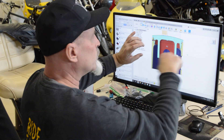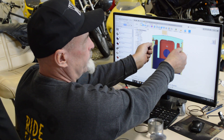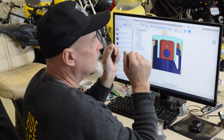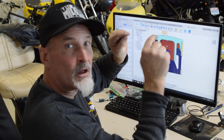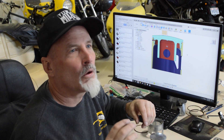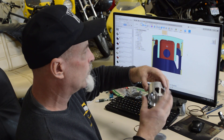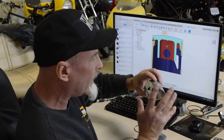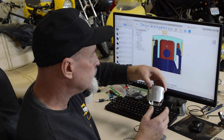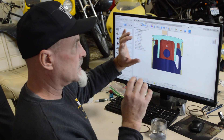We still need to use the trapped ring, so I'm thinking maybe a washer — with the focal point down a little bit — whether that will still rock and push the washer up and trap the ring. I might have to put another shoulder that separates those two. This is going to make a piston that's already a little tricky to make even more tricky, but that's okay. Looking at the wear, I think we've got it down — beautiful wear all the way around, not at the top like before when I was expanding too much. It's pretty much uniform all the way around, so I'm really happy with it. Dimension-wise I just need to get rid of this engineering flaw.